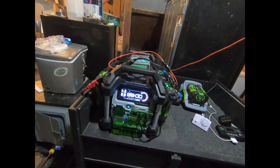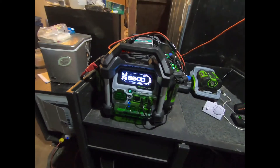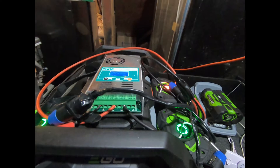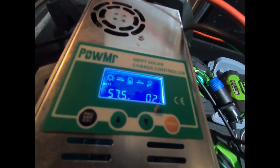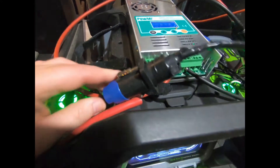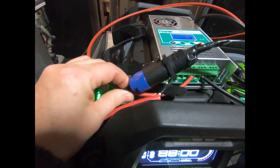The catch with these units is you couldn't do pass-through charging — meaning you couldn't charge it and use it at the same time. Well, now you actually can, because I put a charge controller on it. You can see the actual battery voltage on all four of these packs. I've used Speakon connectors — they're for audio actually, but they handle 20 amps continuous.